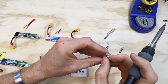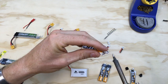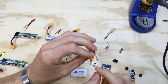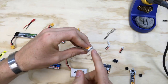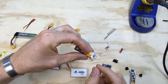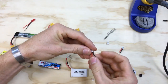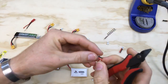Being really careful not to short stuff. I've got my black mark there so I'll remember which terminal is negative. Now there's something I've learned because I've messed it up so many times: if you somehow rip these little tabs off, they have solder blobs on one side and it's really helpful to just solder back into those existing blobs. If you rip one of these tabs it's going to be difficult to get a nice solder blob back, so be as careful as you can not to rip or damage those tabs.